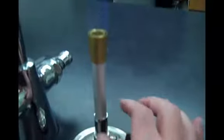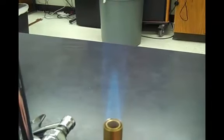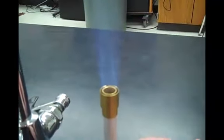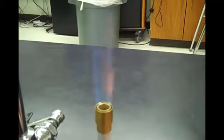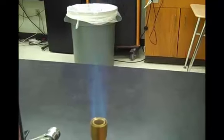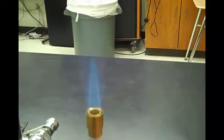If you begin to open up those holes, you can see that the flame becomes a sharper flame — we get that nice blue cone in there. If you continue to open the holes too much, that can sometimes even blow the flame out. When I close the holes, we get a nice softer flame. This is what I'd call a low heat flame, although it's very hot. And this would be what I'd call a high heat flame — much hotter. The tip of that little blue cone is the hottest part of that flame.